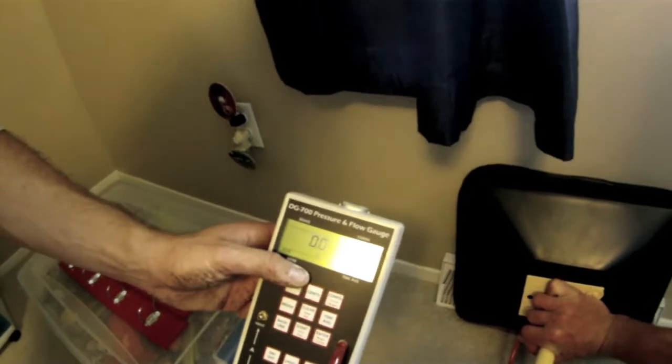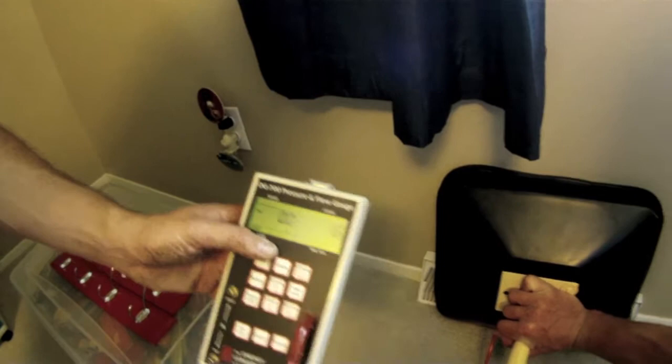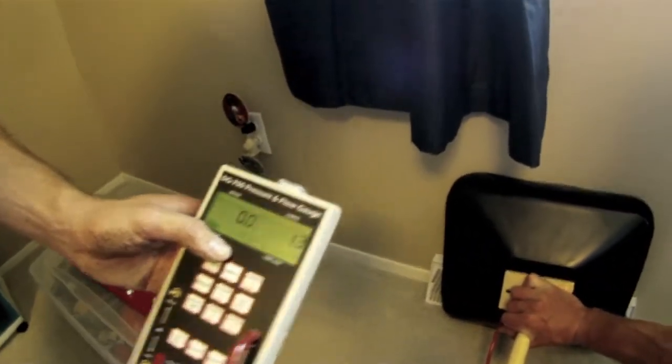That's showing a positive pressure coming between the partition from the basement to the main floor. These need to be foamed out or masticed, or both, to make sure it's a closed loop system. We should have this number below 0.5. Upper has high supply leakage at 1.6; mid-floor average was about 0.9, so that was supply or return. The supplies up here are showing a little bit of a problem.